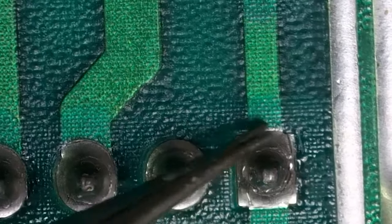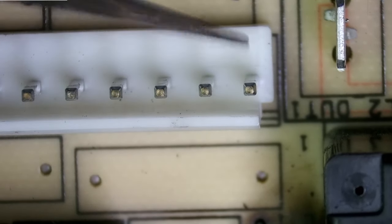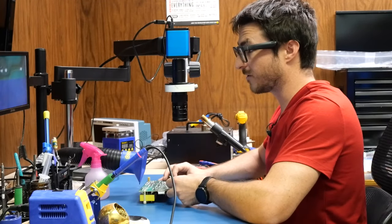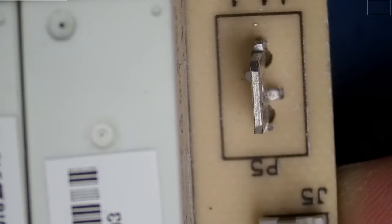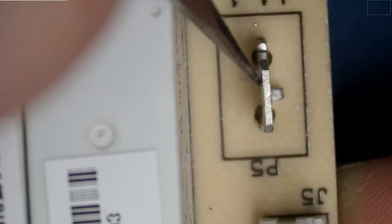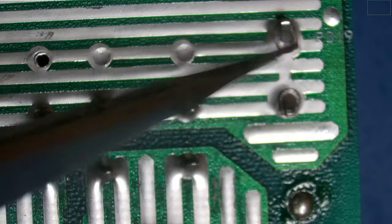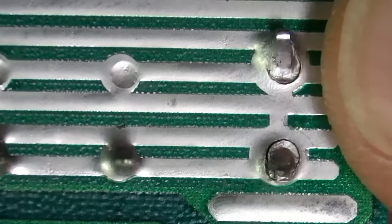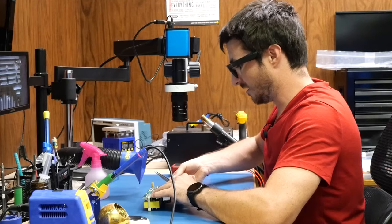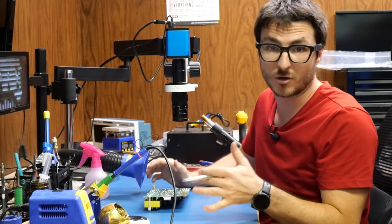This pin also has a ring around it — it does have the ring around it, so we do have a crack there, which is pin one of this connector. So what we're going to do is reflow all of those cracked solder joints. And then there was actually one more, which is for one of our heating elements here, and this is extremely loose. On the back, same thing — we have a ring. These pins are actually completely loose, and if I push on it from the back, you'll notice the pins are just free-floating. They're not making any contact whatsoever. So we have a lot of issues like that across the board. We'll start with the resistor replacement, and then we'll go across the entire board and reflow all of the cracked solder joints.